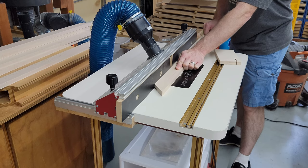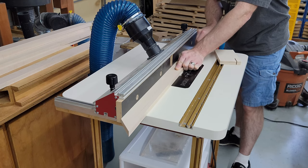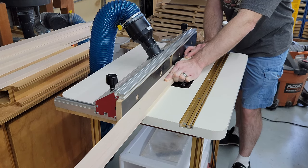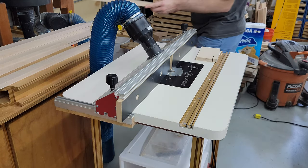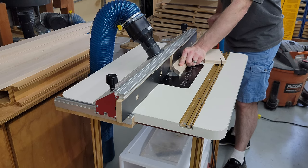I had that nice zero clearance jig on the table saw, but if the frames already had any curves or notches cut in them, those areas wouldn't be able to contact the zero clearance part of the jig, so there wouldn't be any support and chipping could occur. If you don't have a choice, like if you're working with picture frame stock that already has a profile cut in it, you can try to cut some filler blocks to stick behind the board and cut down on the chipping.